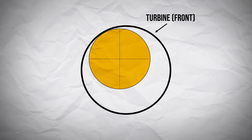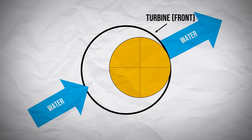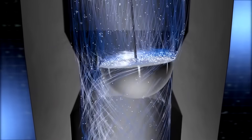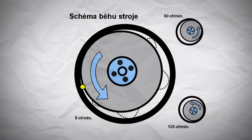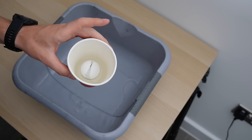The really cool thing about this ball is how it creates instabilities which form the vortex. Before the system starts up, the ball rests on the side wall. As the water flows through it, the ball begins to move and create instabilities. Because the ball is pushed around the inside of the turbine, the instabilities create a rotational effect, providing the perfect conditions for a vortex. As well as going around the inside wall of the turbine, the vortex also makes the ball rotate — like the ball from the earlier experiment.